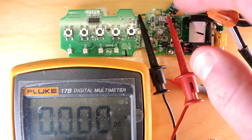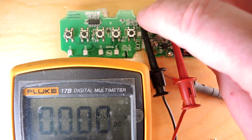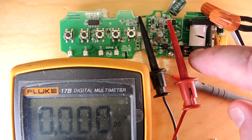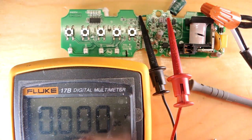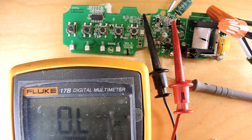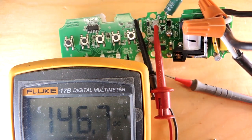I have a probe going across this power resistor that the thermograph said was getting quite hot. I suspect it's dropping nearly the entire voltage converted from AC to DC — probably about 150 volts — down to around 100-some volts. There's probably a little linear regulator because the microprocessor needs 3 volts, but they haven't chosen a switching regulator, so the only way to get rid of that energy is through heat. Reading: 146.7 volts across this power resistor.